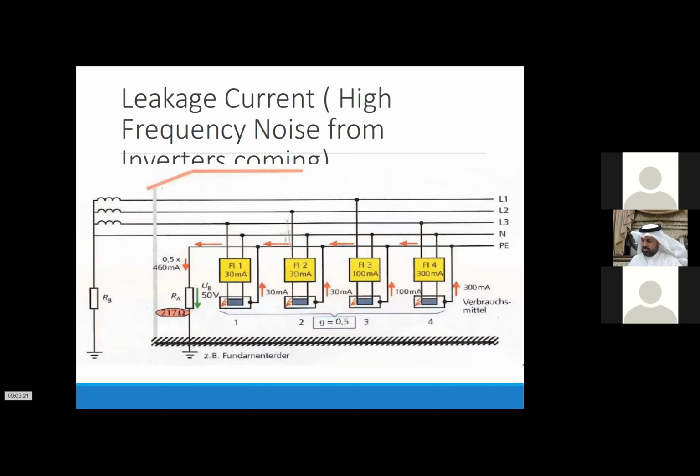And if you face some local laws, I know that they exist, but like I said, there is also a rule in Germany: lightning connection points that are within 0.5 to 1 meter of the modules, you have to align the lightning structure towards the existing earthing structure. So I hope that helps a bit, because if you separate them, it's not going to help you in problems like surge arresters. Okay, thank you.